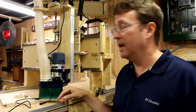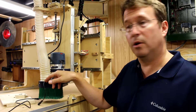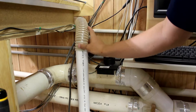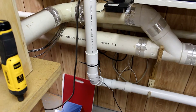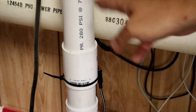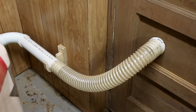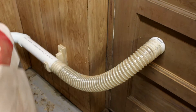So I've finished my smoke collection system, and it starts off here on the router with the laser. You can see I've now got the screen around the bottom of the laser shoe, and so it sucks all the smoke up into the ductwork and sends it out. Normally I would have this hooked to my dust collection with the dust collection gate, but the smoke collection is over here taking out some 2-inch pipe. I actually have a hair dryer fan inside the pipe that I can turn on, and that sucks it and pushes it right outside. I also have made brackets on the wall to hold the 2-inch pipe, and the pipe comes around the wall on the bracket and then goes to flexible 2-inch ductwork out the door, because the door was the easiest thing to punch through.